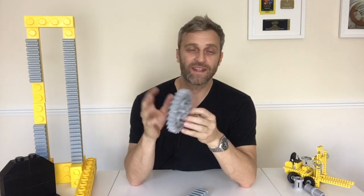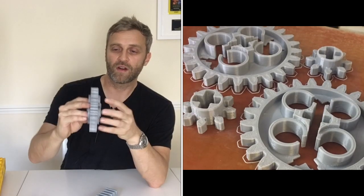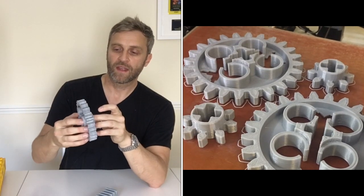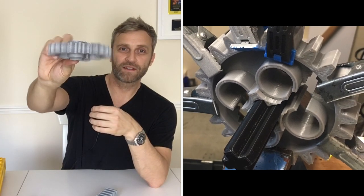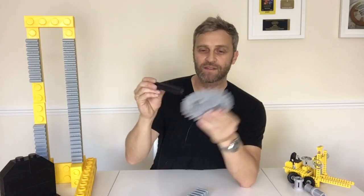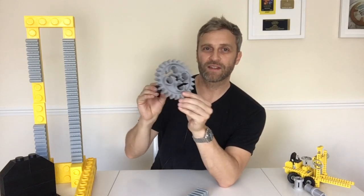It's not a heated chamber, it is just a cabinet around it, and the heat comes solely from the bed of the printer. The cogs are printed in 2 halves, cut down the middle, and ABS welded back together again, so there's no support material needed, which is quite nice. It is a little tricky getting this fit right, so this is way too loose in here at the moment, and it does vary a little bit.